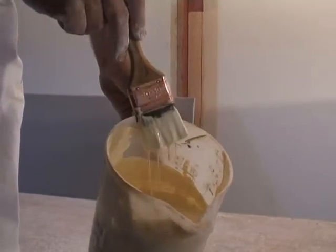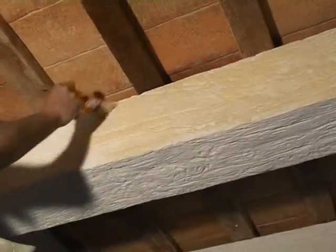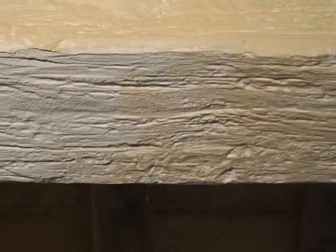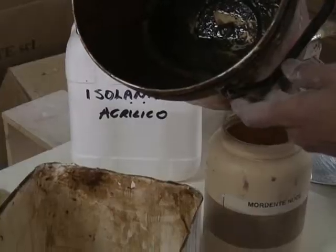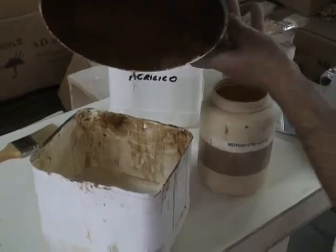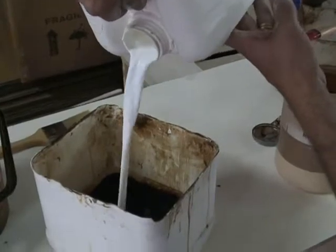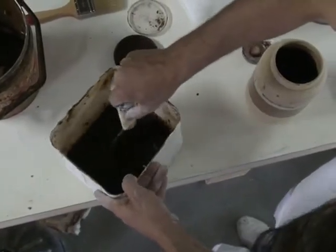Prepare stain that is slightly off tone and paint all of the beams — in this way it is easier to see the parts already painted. Prepare the color wash with 4 liters of water to 100 grams of stain and 1 liter of water-based acrylic base. Test the color before beginning to paint.